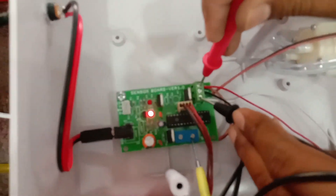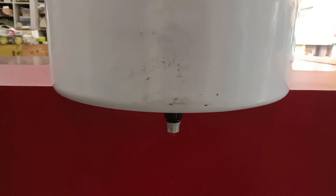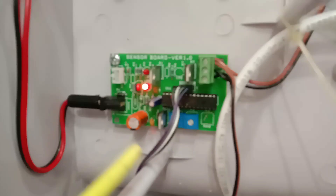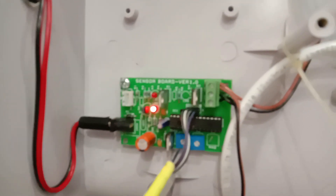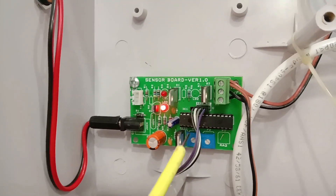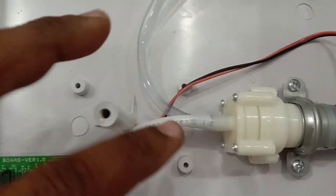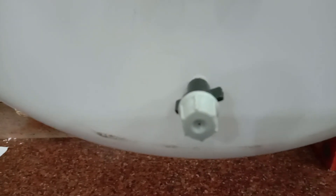The end terminal will be at 24 volt. Now let us test the sanitizing output — when you bring the hand near the ultrasonic sensor the motor will be on and you can get the dispenser output. Let us change the nozzle to the plastic spray nozzle — you can get a nice mist spray. You can adjust the timing using the first preset. Keep the preset to the low condition so that the on time is very less. You can use a stiff tube to the motor, and the solenoid can be fixed at the bottom of the cabinet with the nozzle provided directly to the solenoid. These steps will control the amount of sanitizer dispensed and save the sanitizer. Thank you for watching.